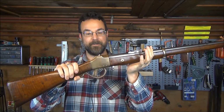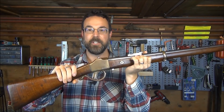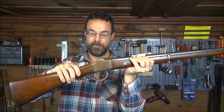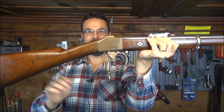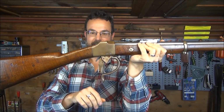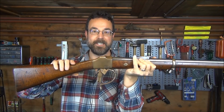So what is a Comblain rifle? Well, it is a very nice, sleek and compact single-shot breech-loading rifle. It is of the falling block variety, more specifically a self-disemboweling falling block. As you can see, everything drops out the bottom. The block, trigger mechanism, lockwork, everything. It is self-ejecting, self-cocking,